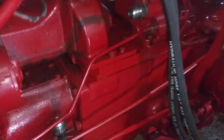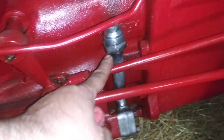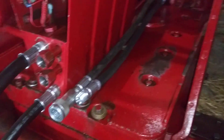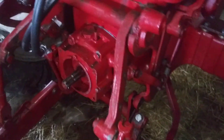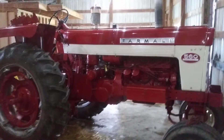The main hydraulic line blew, so we had a guy come weld this fitting right here, and we got a rubber line to run up in there. The gentleman before me had this all plumbed crazy — it was just pouring out fluid everywhere. So I routed some new remotes back here, new lines from the fast hitch.